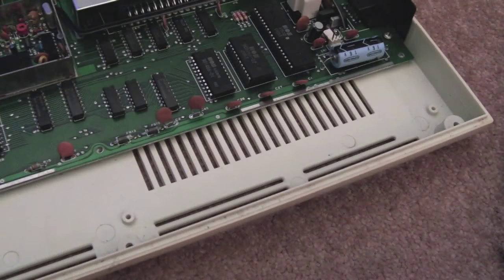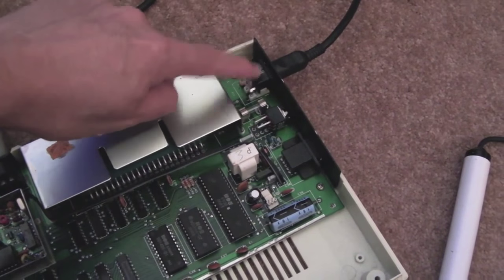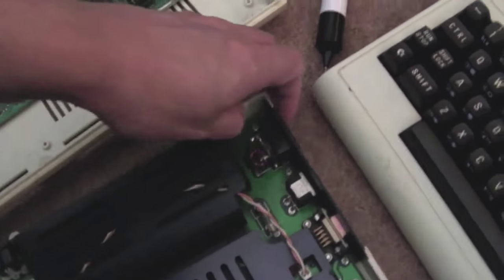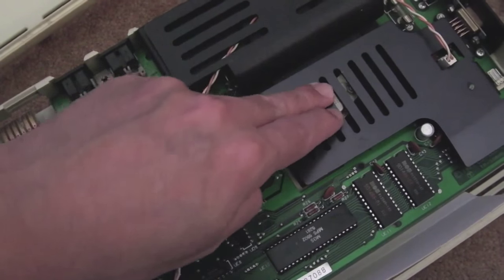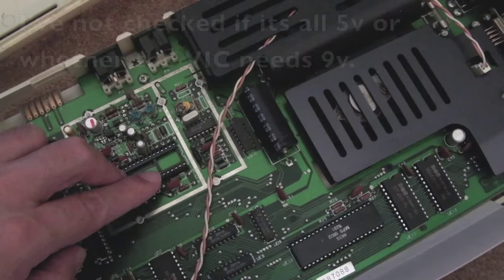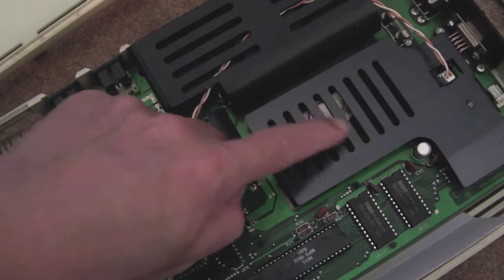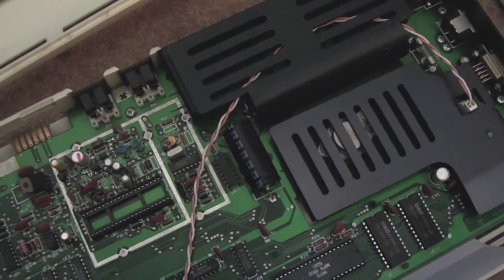I'll show you the other one now — I've just whipped the lid off. This is the original version, so it won't be easy to film because of the shielding, but you can see the board is a lot larger compared to the cost-reduced version. The other difference is this uses the DIN-type connector for power, so I'm using a Commodore 64 power supply with that, which is working fine. Whereas this one has a nine-pin AC connector, so it's a different power supply — the five volts is derived from nine volts. It's got its own five-volt regulator, hence these massive heat sinks.